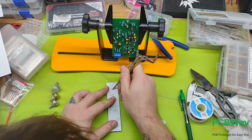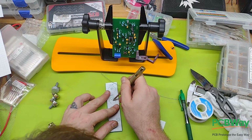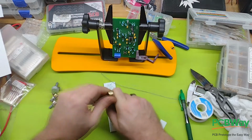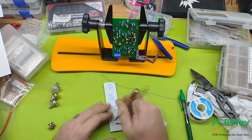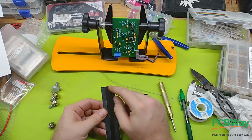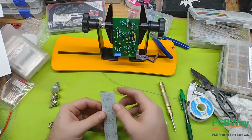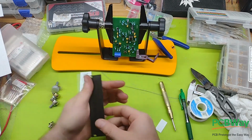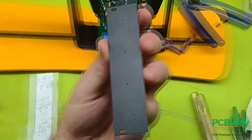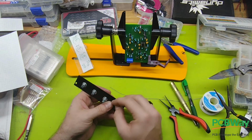But anyway, I'm going to take my punch tool, and it's an auto punch, which means all I've got to do is slam it down, and every one of these grid points gets marked, with all that racket. These will be mounted on the right. I'm going to drill from the back, and that'll flip. Cool. All right, that'll look nice. That can just sit right there. And look, just to hold that up, zoom down a little bit, you can see that left us a pretty good set of holes. There we go.